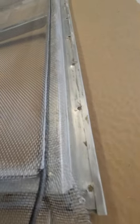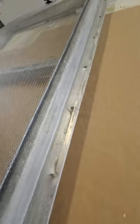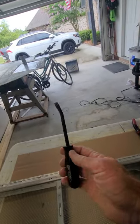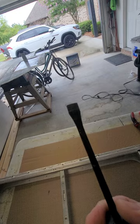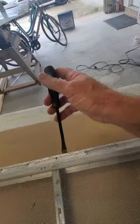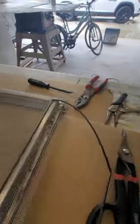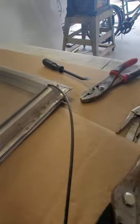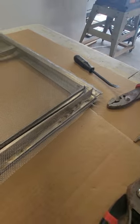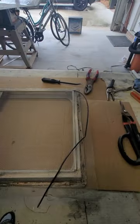I literally just came out here from my desk to try it. Pressing this pliable cord into the groove is so far working. I'm using this small angled pry bar — the most important thing is it's not sharp or pointed — it just allows me to press the spline all along the groove. I haven't made the corner yet and I'm nervous about that because it could pop out, but my goal is to keep working slowly and methodically all the way around.